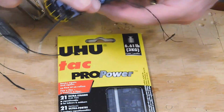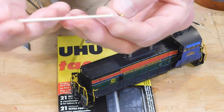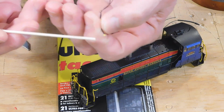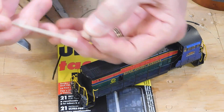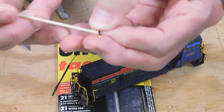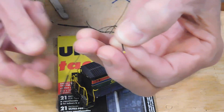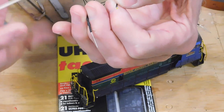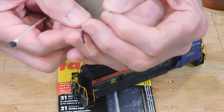And what I've done is I've installed these golden daylight LEDs that I get from China. They're off of eBay, and I'll put a link to that in the description in case you want to look it up. They're a very tiny little LED, and they are extremely bright though, and they are great for this purpose. And they come with a 1000 ohm resistor already attached, so you can just hook them right up to your decoder and you're good to go.